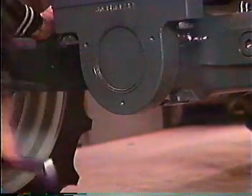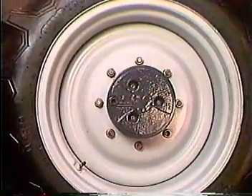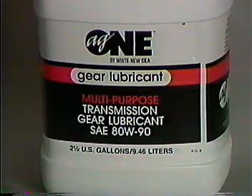If the tractor has a power front axle, check the drain plug for tightness. Fluid level must be checked in the differential and planetary sections of the front axle. The differential section is checked by removing this plug — fluid level should be up to the bottom of the plug opening. To check the fluid level of the planetaries, rotate the wheel hub until the words 'oil level' are horizontal. Remove the filler test plug; fluid level should be at the bottom of the filler test plug opening. If additional fluid is needed, use 80-90 multipurpose gear lubricant for both the differential and planetary sections.